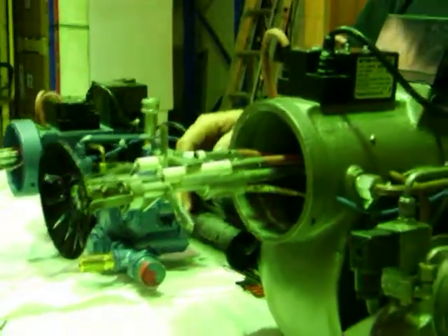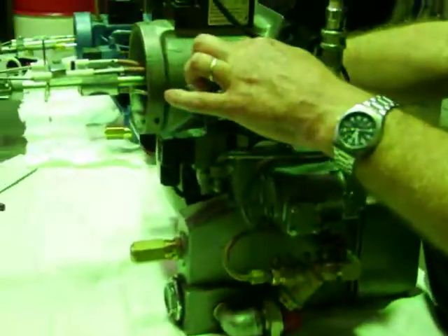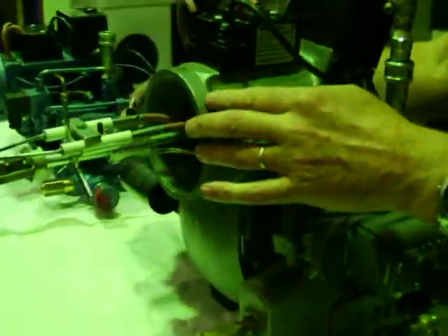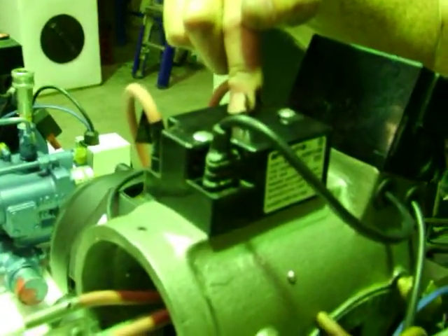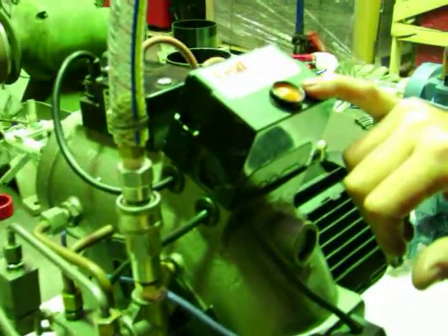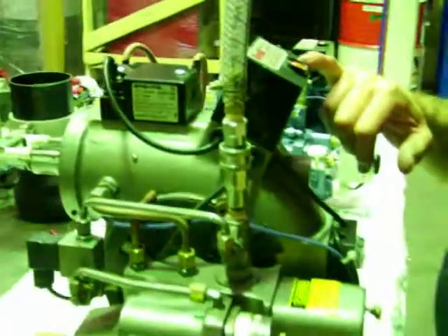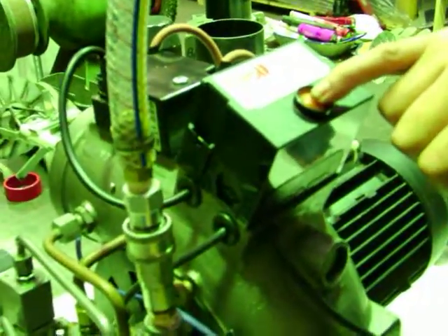Let's look at the body of the VR10. This is what we call the scroll — it's the chassis of the burner and it's very solid and heavy. Sitting above that is the ignition transformer, which produces the spark. Sitting behind that is the controller, which has various safety functions such as detecting that there's a flame and also looking for darkness at the beginning of the ignition phase. This button here is a flame failure switch and it'll go bright red if the burner has gone out for some reason.